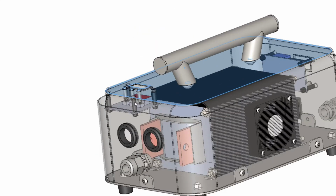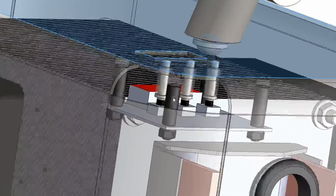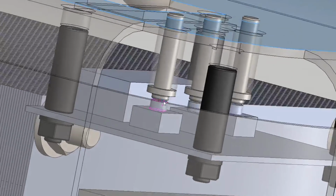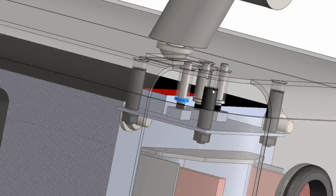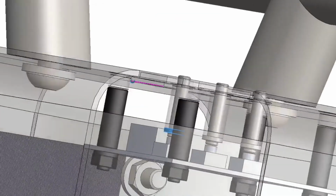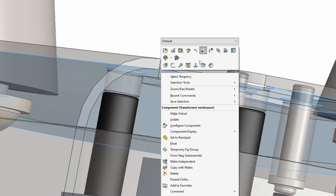There are settings that can be controlled using them 3 buttons. Let me see if I can get through the hole here. I'll zoom in. So here we have the 3 buttons for the digital stat. There's a display there, but these buttons, or these sort of 3mm shafts, control the buttons on the PCB board. The board is mounted to the cover using, let me see, these wee bolts, which are transparent at the minute. Let me see if I pull it out.